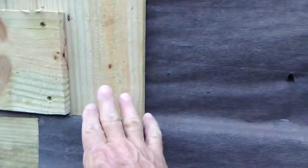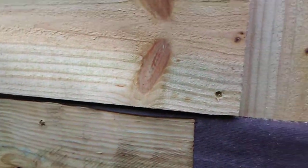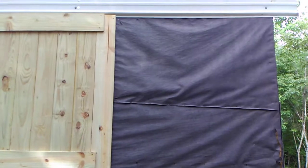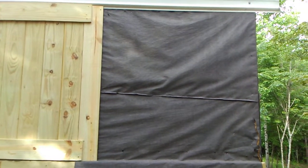Again, if budget is an issue, let the roofing felt overlap and then after I get it up I take a razor blade and trim it off just for looks. I've got to get a few more — the boards are eight foot and I can cut them in half. It just worked out that that's a four foot gap there. Didn't plan it that way, that's just how it happened to work out when I built the building and closed it in.